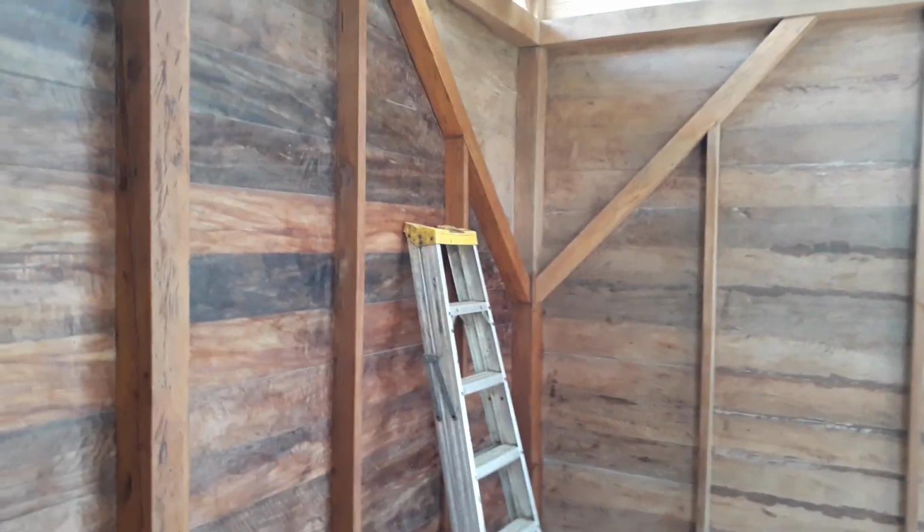We're also going to do this on the exterior of the house. You can see this wall hasn't been done yet, but this wall has. So we're going to continue going and then do the exterior. It is supposed to help protect wood from UV and help stop the dry rot. Now, linseed oil is good at preventing dry rot.